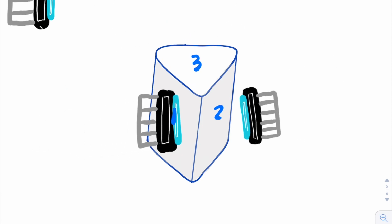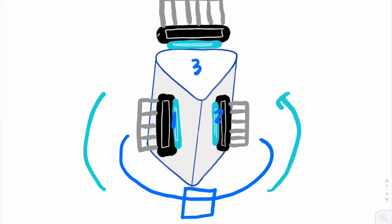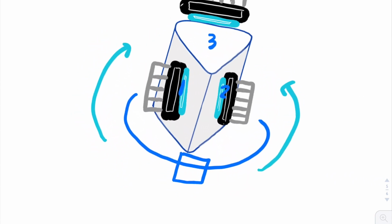These 3 inward-facing cooling plates and assemblies sit atop a slip ring, a low-friction rotating disc that is driven by an adjacent low-horsepower motor. When power is supplied to the cooling plates, the motor is engaged and the tumbler, along with the 3 cooling assemblies, accelerate to a rotational velocity of about 100 RPM. When the drink is ready, the spinning slows to a stop and the user can remove their drink from the PIPO Chiller. All in all, the aluminum triangular-shaped tumbler, along with a spinning effect, allows us to chill a drink to any desired temperature in seconds when combined with the other aspects of our device. A main benefit of aluminum is thermal conductivity. This plays a major role in the efficiency of our chiller due to its ability to transfer heat effectively.